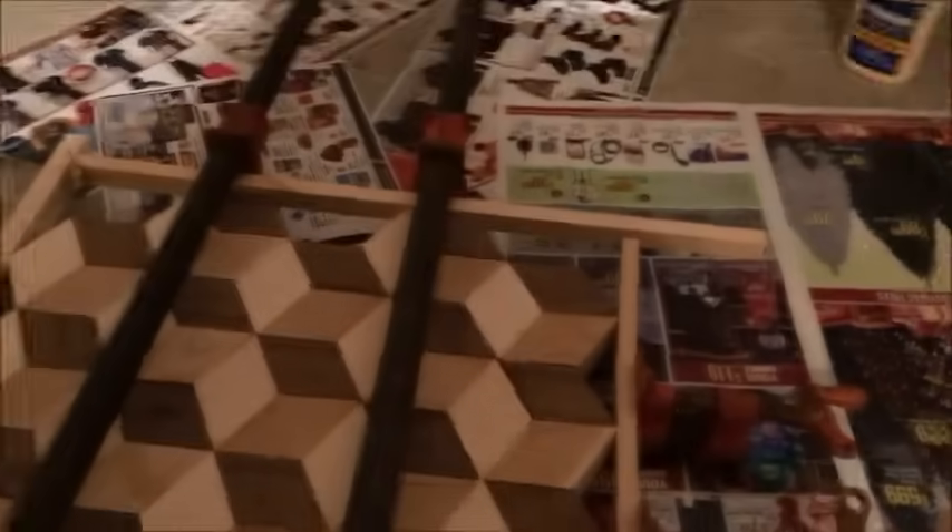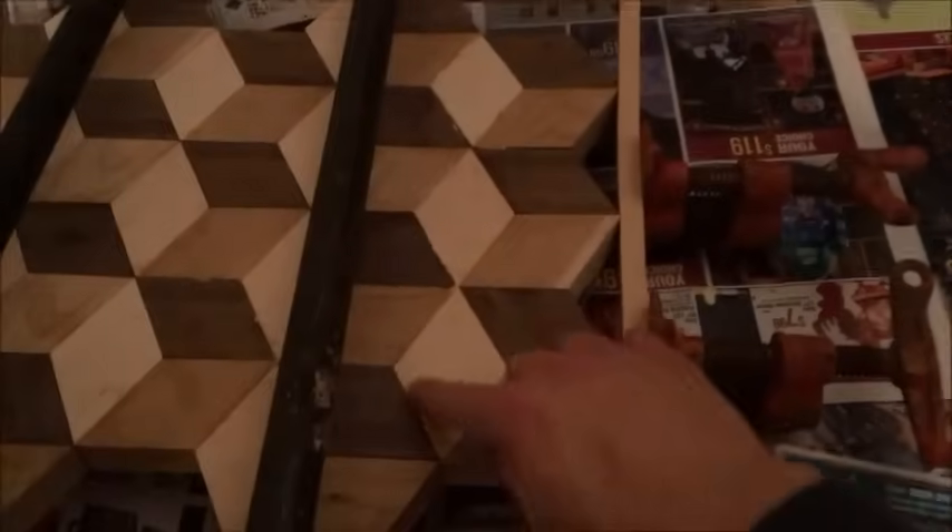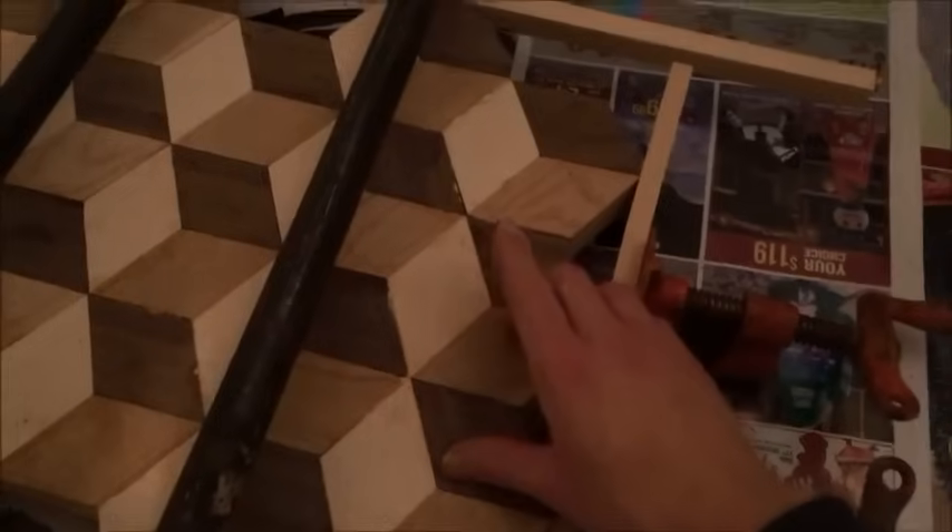I have it all in one piece now. I used my pipe clamps and grabbed some scrap wood, went all the way around so I can get my clamps nice and tight in the cracks. I had a little bit of trouble though — one piece I did not need had four; I needed only three at the bottom. I don't know what I was thinking, but there it is. Now we'll wait for a day and run it through the planer next.